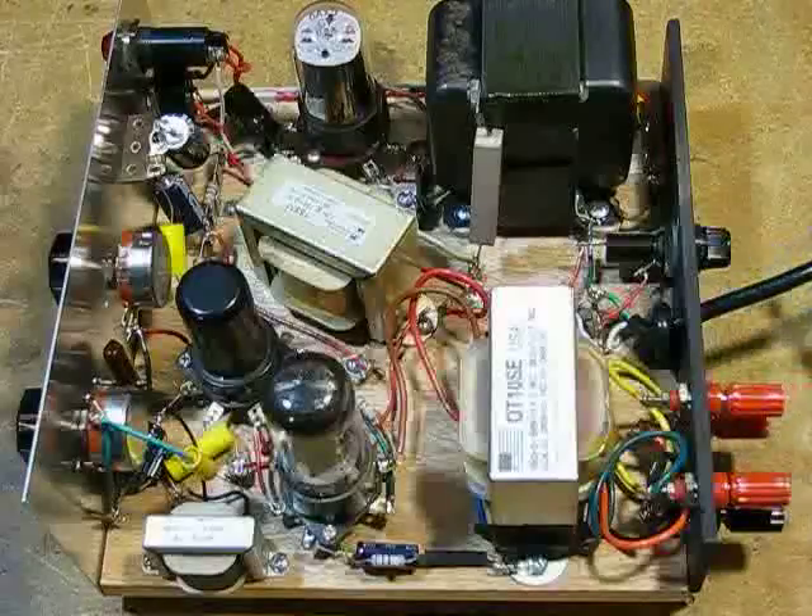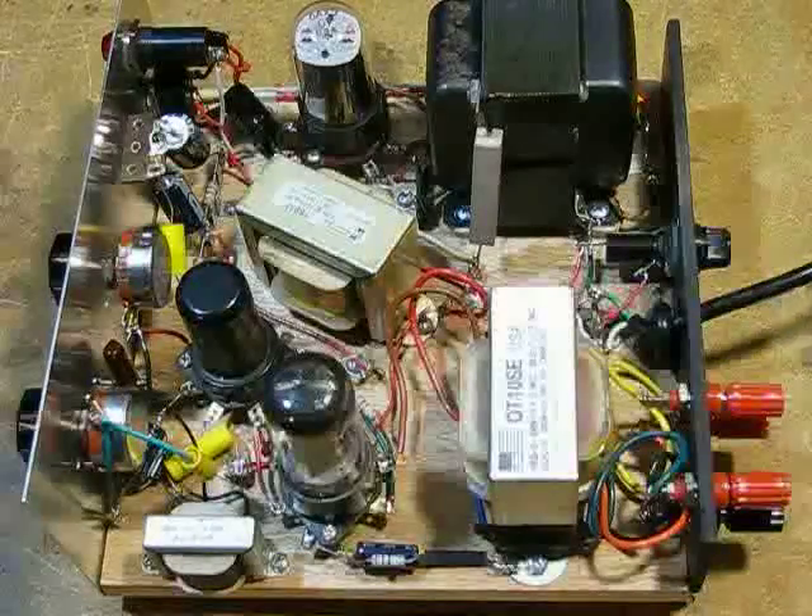And naturally, my power cord is 3-conductor. As you can see, both my shortwave radio and my amplifier were built using breadboard technique. I like working on breadboards. Aluminum chassis are expensive — you have to have chassis punches for the tube sockets, and you often have to do a lot of mechanical nibbling to make parts fit. For anybody planning to build something on a breadboard, I have a couple of handy hints I'd like to pass along.